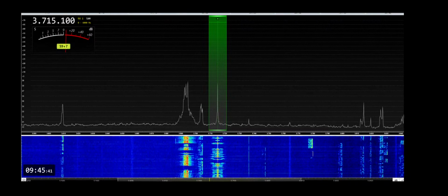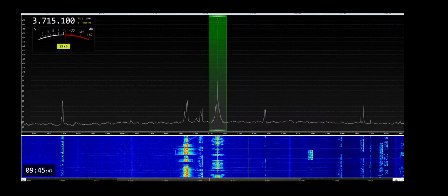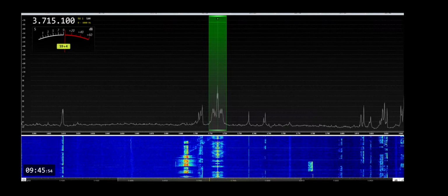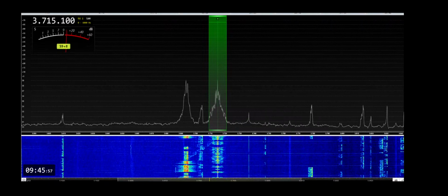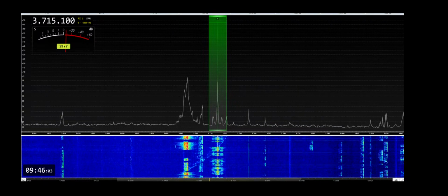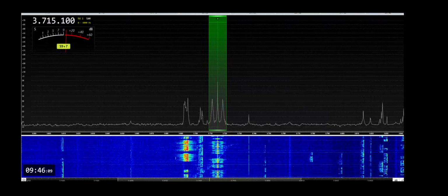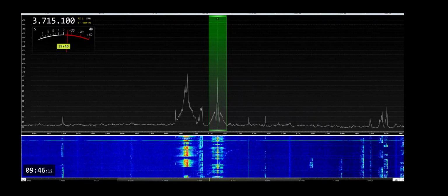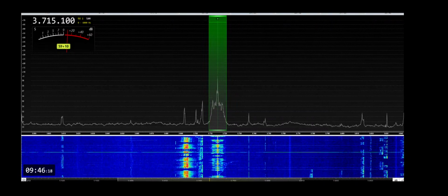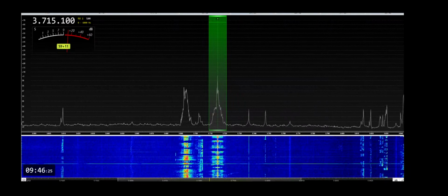And definitely most or all of the instructions that I have read talk about tuning with CW first, and then switching to either AM or single sideband. But I think you'd do well to read the section 62 in the ARRL handbook on grid modulation, screen modulation, sorry, and get a feel for exactly what's going on.